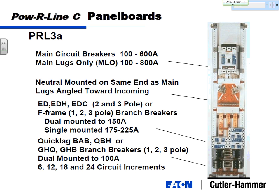So this is what the 3A looks like. And when I was talking about the sub-chassis here, these are the normal breakers at the bottom. So I can put a bunch of those standard breakers, but yet I create a little bit more chassis room to put those bigger breakers. And a normal main breaker, and we actually put the neutral in the middle of this panel. So that's one kind of odd thing there.